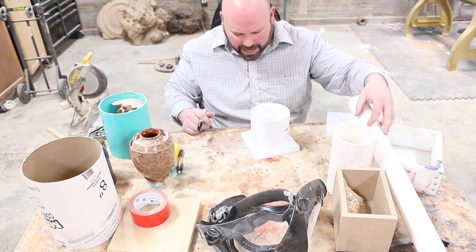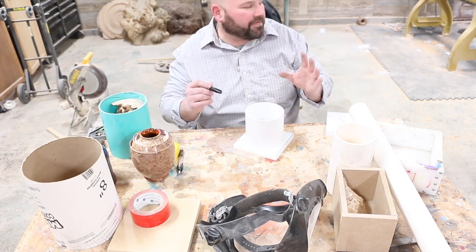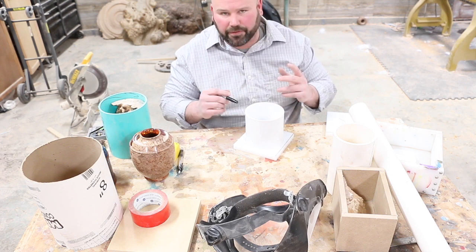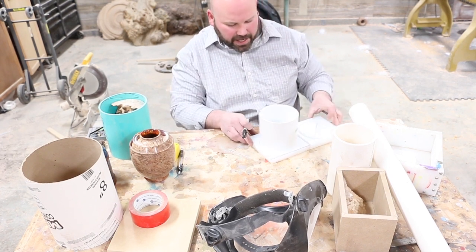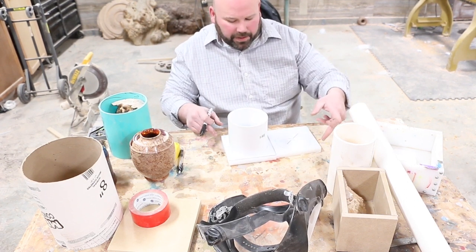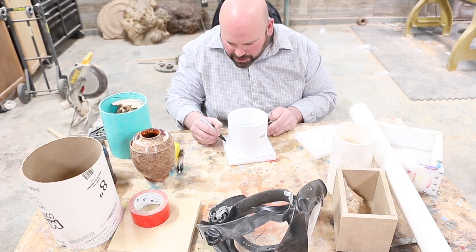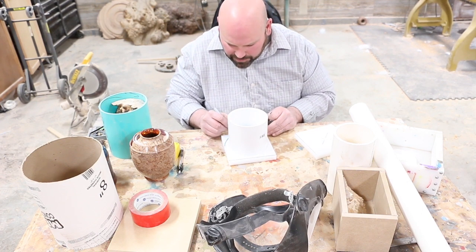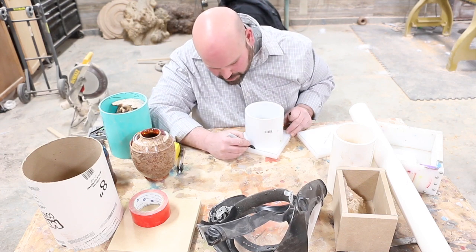And then the very last thing that we're going to do for these molds is, this is just for me, and I found out this early on. If you got a 5-gallon pressure pot like me, and you want to put these things side by side, the problem is that the diagonal distance, you won't be able to fit them in there. So what I like to do is take them over to the bandsaw. We're just going to do this freehand. Just knock all these corners off.